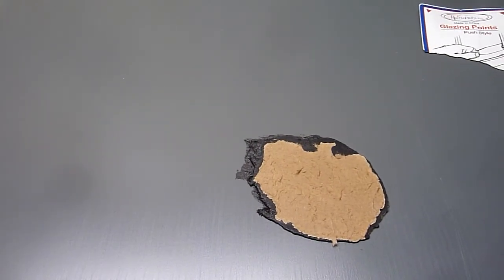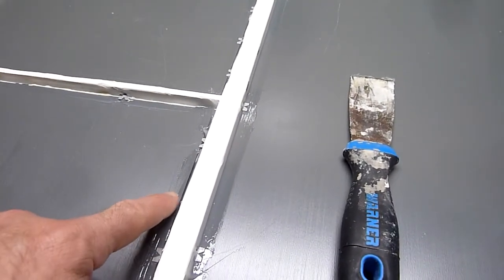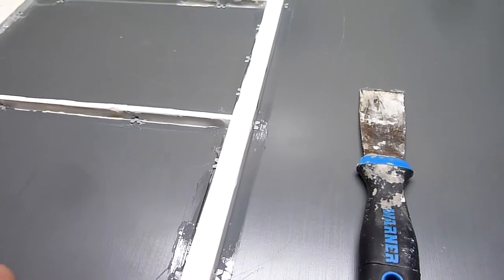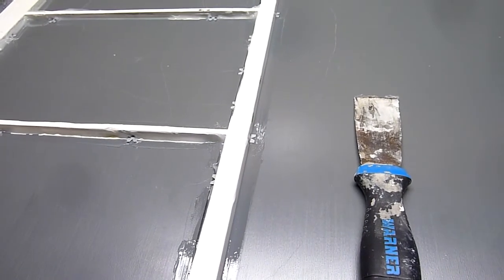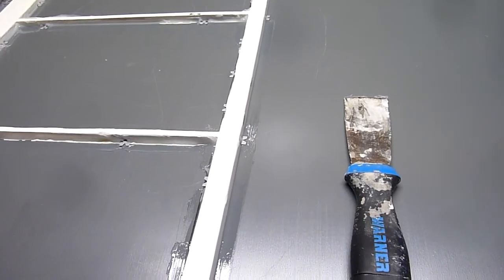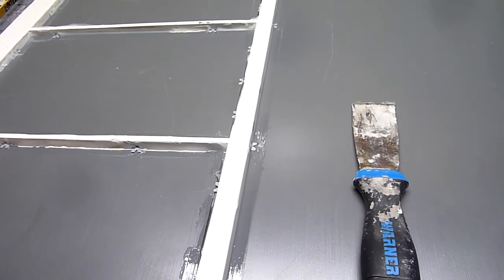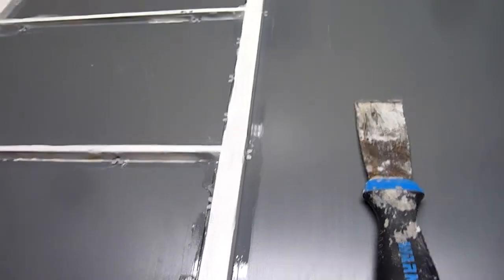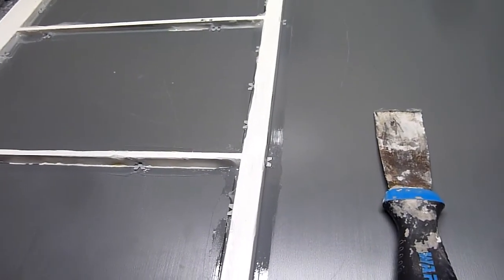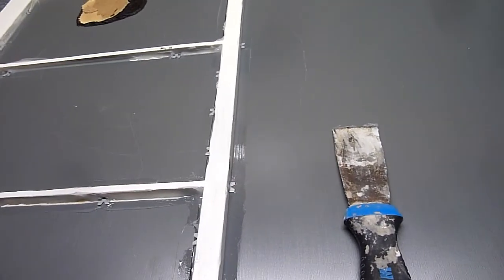So to install it: cleaned it up, cut it to fit, did a dry fit to make sure everything worked, and then I just put a bead of clear silicone in here. I did a little research about what to use and a lot of the glazing putties are a dark color, which just don't look good with a mirror because you can see it from the other side. So I used clear silicone. You can still see it in a couple of spots because the cutting of the mirror was not precise — there's a pretty good gap here. On the other side you might see a little bit of a reflection of the silicone, but it doesn't show up as much as a dark putty. So I put a clear bead of silicone, pushed the pieces in, and filled in any gaps with the silicone.